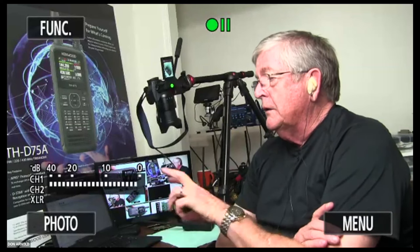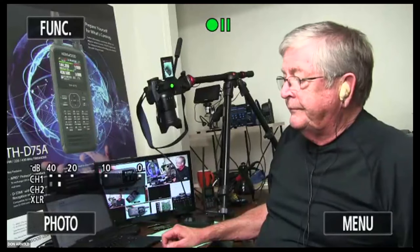But I've also got something that came with RT Systems to hook it up. Is that the same thing? That's the adapter. That's just a USB cable. You have to get a charger for that. Would that be okay to hook up to the computer? Yes, that's what I'm talking about. If the cable from RT is a USB cable, that'll work for both charging the radio as well as programming it with the D75, because it allows power through USB-C. Does it allow the power charging too? That's correct. Okay, then I don't need to buy one. It looked like a very nice adapter. Do not transmit while using that cable though. Okay, I got all the warnings on that.